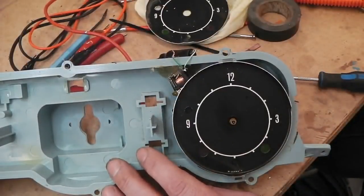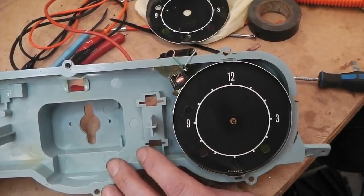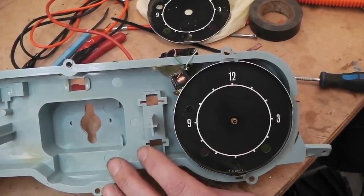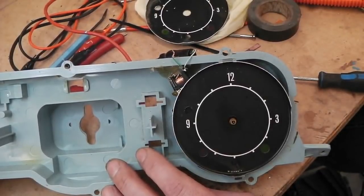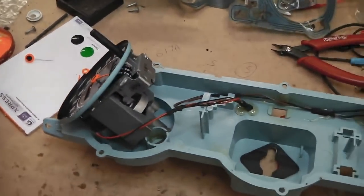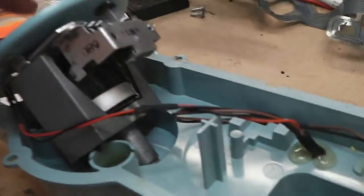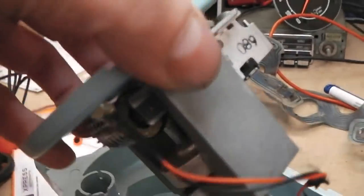Now we've got to put the cruise control lamp into the speedo that tells us the cruise is on as well. That's another extra feature that we have. I'll fit that now. Little LED into the speedometer between 50 and 60, same as Ruby. It dims at night, so if you cruise on at night it's a very faint red lamp, brighter in the daytime. Okay, everything's in and wired and ready to start reassembling this. There's our cruise control lamp, just fitted nicely into the dial face.